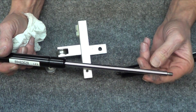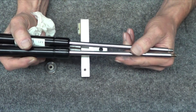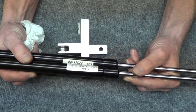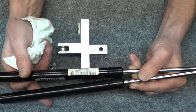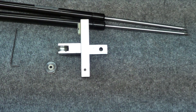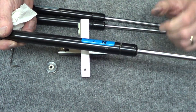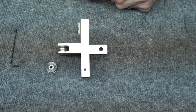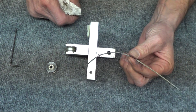Checking these pistons out too. I remember saying in the first video when I talked about this mill upgrade that I had bought two pistons that were too weak and then I bought the next ones up. But looking at this — it says PI 20 pounds. Being pushed to take this apart, I could easily compress these, so they're worn out. I was playing with the old ones that were too weak and these are actually stronger right now, feeling compressing one at a time than the other ones. So I'm going to put the other ones in and it should hopefully work out. That's a little heads up if you guys do this upgrade. I'm lucky that I caught this in time — if that would have snapped while I was milling something I would have been really angry.